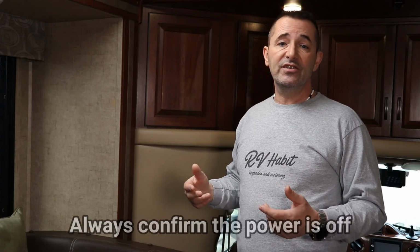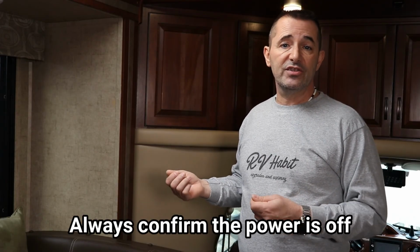It is hardwired. It's a 12-volt system. Turn your light switch off so there's no power going there, and just simply 2 wires. Make the connections to the 2 new ones and put it back up. You saw how I did it in real time. It's super, super quick. Amazon sells a lot of different types. I'll leave links to some of the most common ones you find in RVs down below.